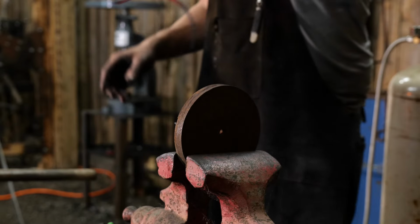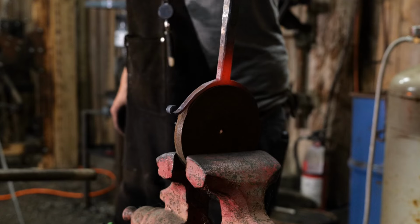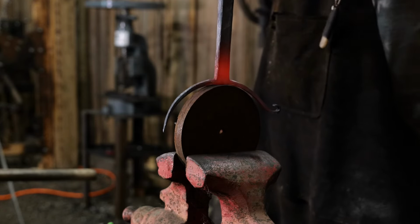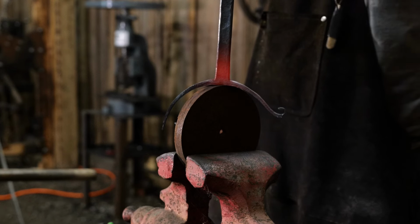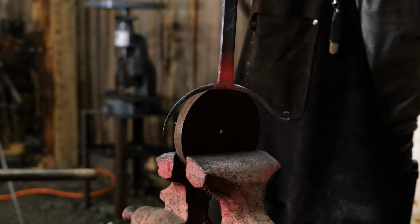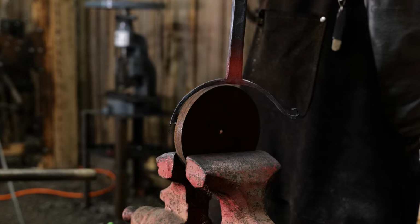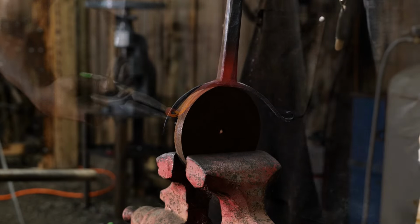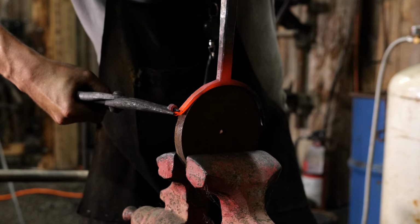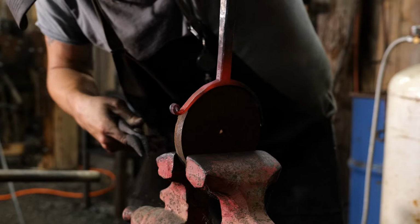But you can see, if you hold that back down, Thomas, in front of the deal there, show both legs. Show both legs. There you go, to the camera. Angle them to the camera. You can see how much material one of those little rat's tails on the end take up. They take up approximately 3/4 to 1 1/4 inches of material, depending on how tight you roll them up. So on this particular wrap, we are not wrapping it very far, about like what he has it right there, where basically it points back skyward.